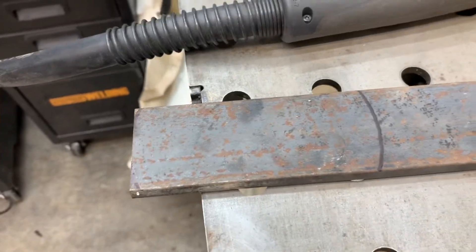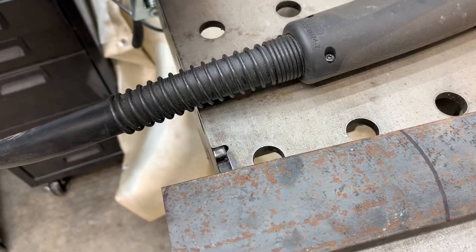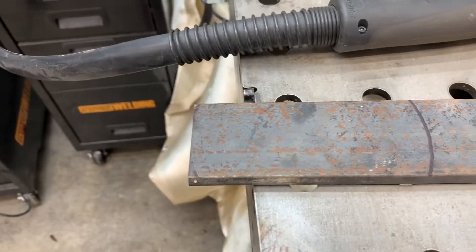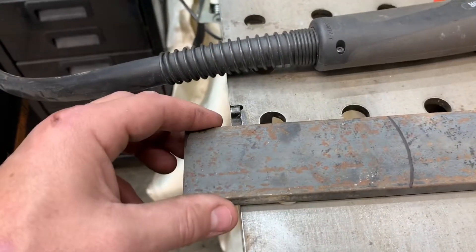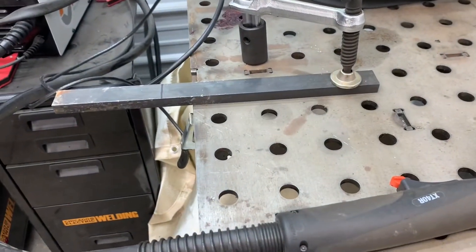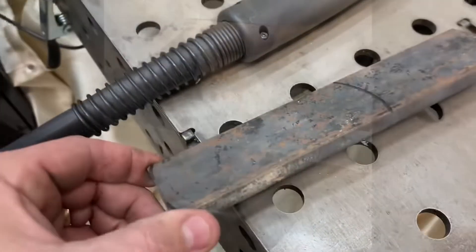The shoulder, I guess. Then I'm going to weld this to the bottom of this where it goes, and then I'll just slide the whole thing down once the liner's in there — a couple of bolts in the cylinder head bolt holes, tighten the whole thing down, put pressure on the liner, and then I can measure the deck.